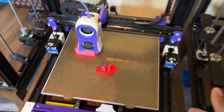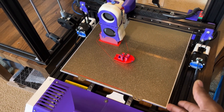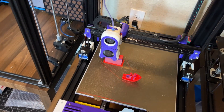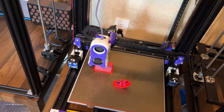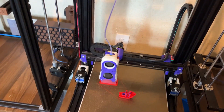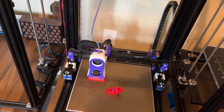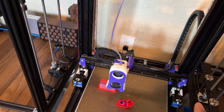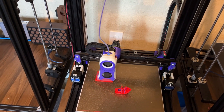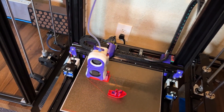I also updated my Switch Wire. I went with a thicker bed — a 6mm thick, 300x300 bed. Just to get a level bed, because the stock 310mm bed that comes with the Sunlu — like the Creality — tends to have a lot of warping issues. That's why a lot of people use glass with those beds, since glass is typically flatter than aluminum. In this case I went with a thicker aluminum bed.